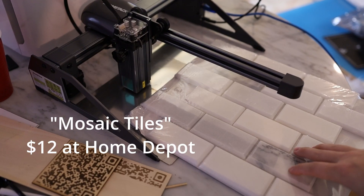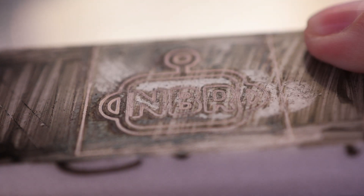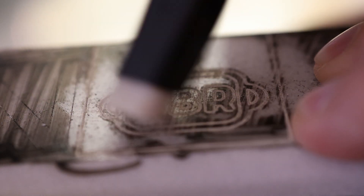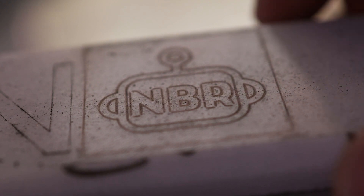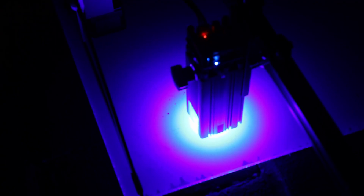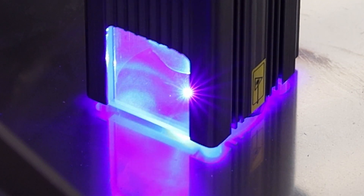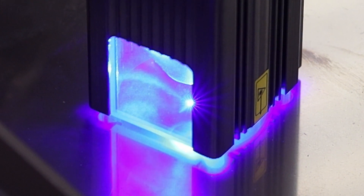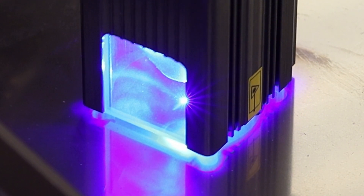I got these tiles at a local hardware store — I'm getting 18 tiles for the price of one. This actually turned out looking pretty good. That's definitely etched on there. If I try and brush off this dry erase marker, you can see it's engraved into the stone with this tiny little machine — in stone! Now if this were a darker stone it might have been able to engrave it without the marker, but since this is so white and translucent, the laser dissipates through it. I think the marker helps absorb the energy from the laser. Metals are one of the hardest things to cut or engrave with a laser cutter because they've got extremely high temperature resistance and melting points, and they transfer heat very rapidly. As the laser is dumping heat into a point, that's being transferred away by the steel very quickly. Wow, I am very impressed — I think it's able to engrave these things because it comes to such a fine focal point.